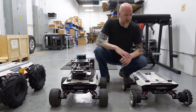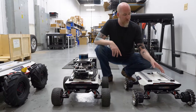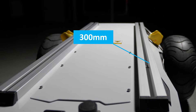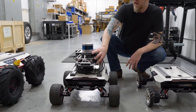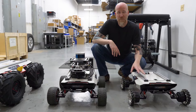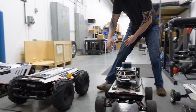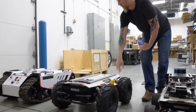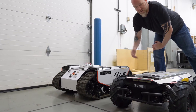One hardware feature I really like is that the mounting rails on these platforms are the same across every single unit — 300 millimeters wide, using large industrial T-nuts. You can mount things like sensor towers, robot arms, or whatever sensors you want. Walking down the line you can see every single robot has them, all the way up to the Bunker, and they're all the same size. That was very smart — they made everything universal.